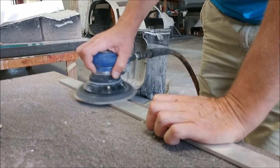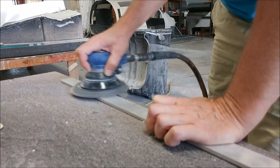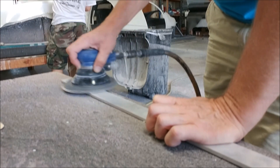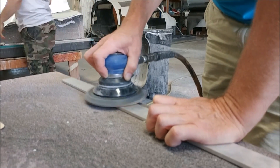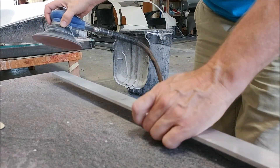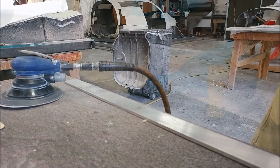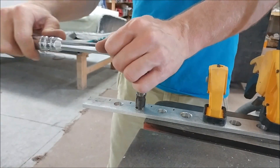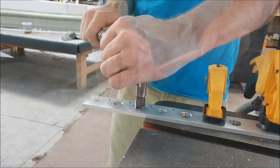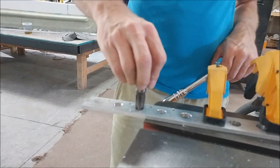Here I'm prepping up some aluminum which is going to make hard points on the header tank, which lives behind the cabin. I'm prepping it all up at once — drilling holes, tapping them, and then cutting it into small pieces to make up the various hard points for where fuel, air, and breather lines go in and out of the tank. Here you can see me tapping one of the holes; most of them were three-eighths inch NPT, with a couple bigger and one smaller.